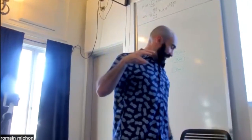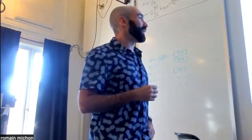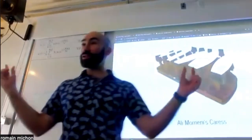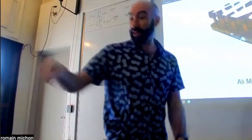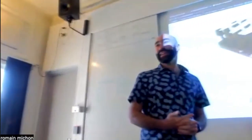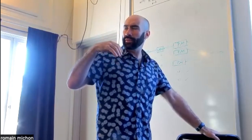Okay. All right, one thing that I wanna say about this, because I know that some of you are already thinking about this now, I'm just gonna warn you that it's probably not gonna work if you try to do this. So every year, there's at least one student who's like, all right, I'm gonna do something really smart, and I'm gonna put a piezo here, and I'm gonna put a piezo there, and then I'm gonna be able to tell where I'm striking on the table, because I can measure the time difference between the piezos, okay? See the point? And then if you add another piezo and you put it here, then you know how things work in 2D, right? You can do triangulation. And so it's not gonna work if you do this, because this material is super stiff. Sound travels in the air at a certain speed, 340 meters per, 340? Yeah, I always forget.